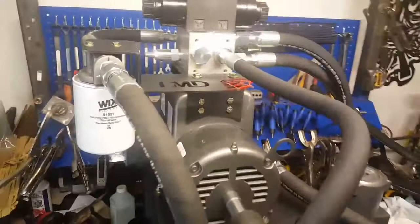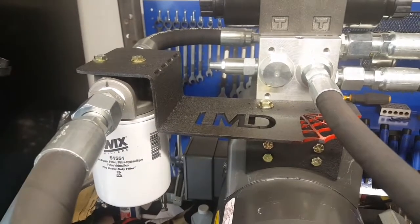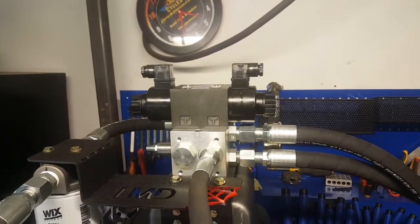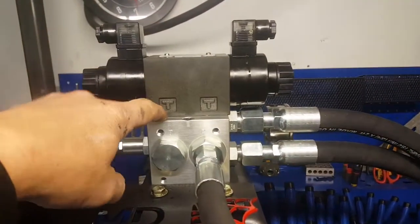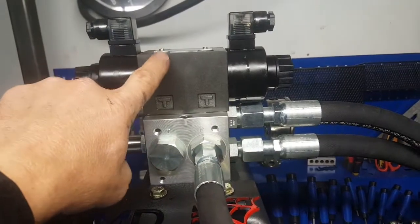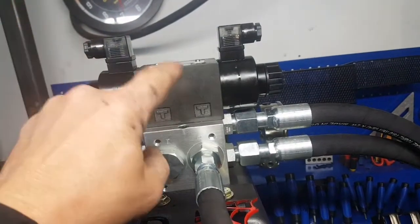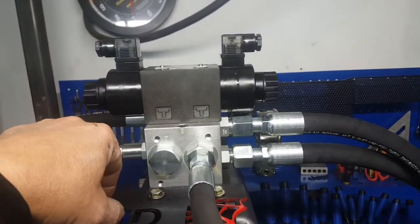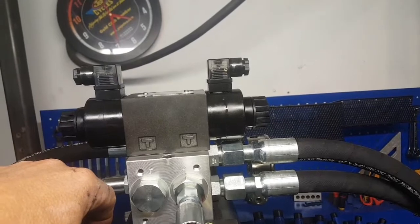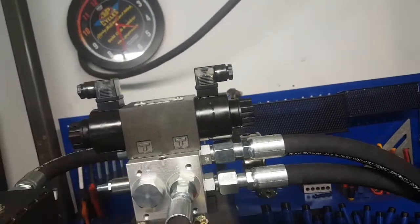The lines came in today, I brought them home and hooked everything up. I also had to make an additional bracket for mounting the hydraulic filter. This is the electrically actuated spool valve — I had a bit of a hiccup with it. This block is fairly long, and I assumed the valve mounts in line with it, but none of the mounting holes or ports lined up. I sent pictures to the company and they wrote back saying to rotate it 90 degrees, and once I did that the ports lined up and it bolted down perfectly.